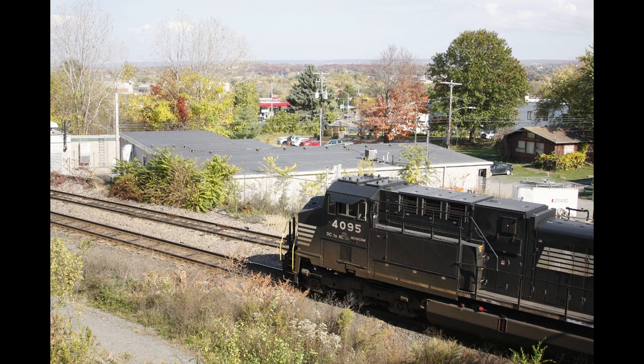One reason that I think that GE locomotives were rarely ever rebuilt in the past was that new engines were rumored to be required to replace the existing engines, which suffer from cracks in the cast crankcases after 15 to 20 years of service. By comparison, EMD units rarely required new crankcases, replacement of the power assemblies often being all that was required. Personally, I was surprised that the original engine was used in the Norfolk Southern GE DC to AC rebuilds. In comparison, the Hammersley Iron Dash-9s had new engines, or at least new crankcases, after only 10 years, albeit 10 years of brutally hard service.